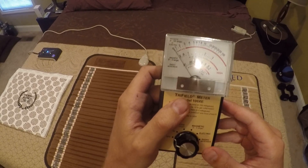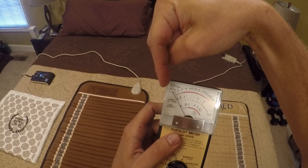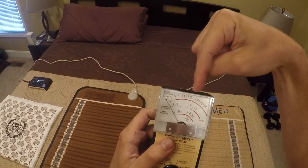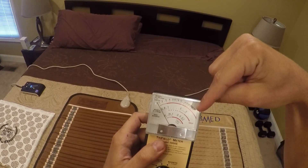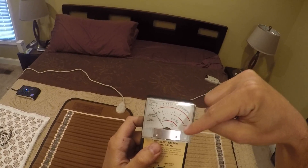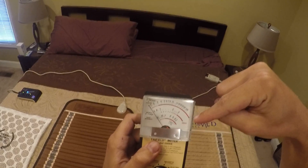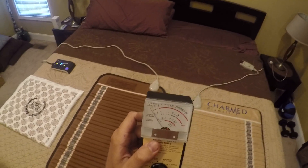This scale is a logarithmic scale. More than half of it goes from 0 to 10 milligauss, then 10 to 100 takes up most of the rest, and it does go past 100. So if it buries the needle all the way out, that's a very high reading — probably 500 plus milligauss — because it is a logarithmic scale.